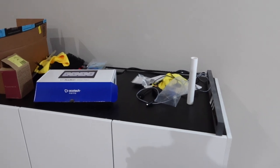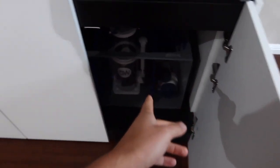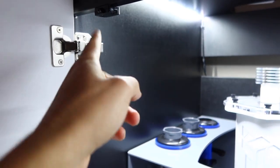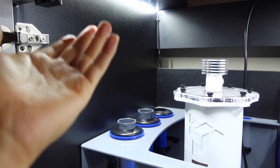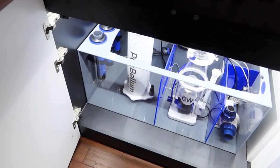I'm really hoping for that — I have a lot to do and I'm going to take my time to make sure it's done correctly. So let me show you the light switch. When I open this door you can see the switch — power on, and when you close it, the soft close shuts it off. It's very simple — all you're doing is interrupting the red power wire and running it through the switch. The switch becomes a circuit when pushed in, and breaks the circuit when pushed out. Very simple and straightforward — a great mod to add to your cabinet.